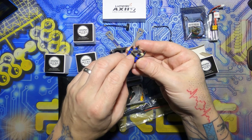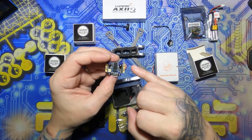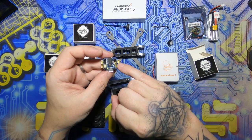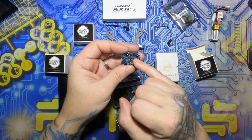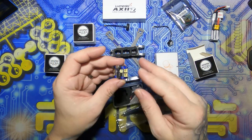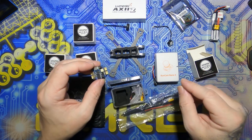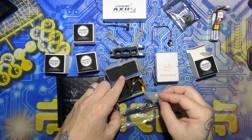The stack is connected by pins in the middle and has a couple of nice little features. One being it has inverted and uninverted SBUS, which enables me to do F-port. It's either 12 or 15 amp on the ESC — I forget which version, I'm sure it's version two. It's got a little socket for a video camera to attach to, so we'll get to that next.